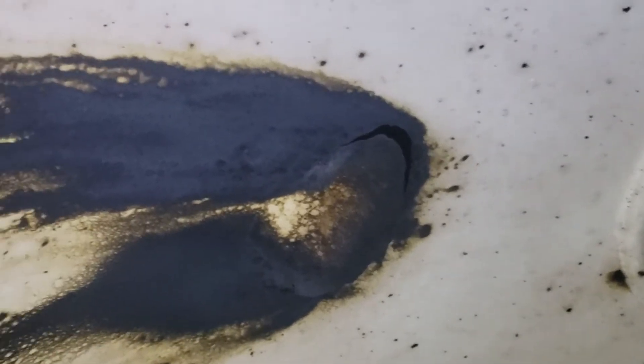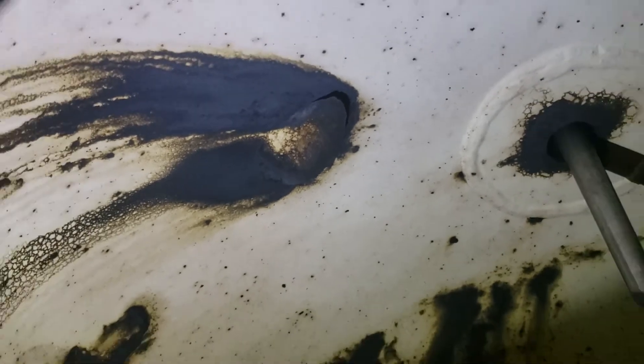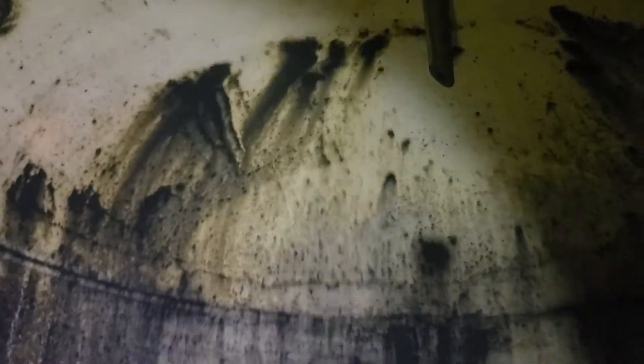The black you see is the reaction between the process and the carbon steel — doing a little staining. The coating is actually this bright white color, and you can see on some of the areas you're getting some hydrocarbon staining.